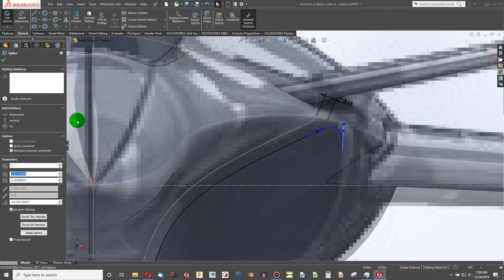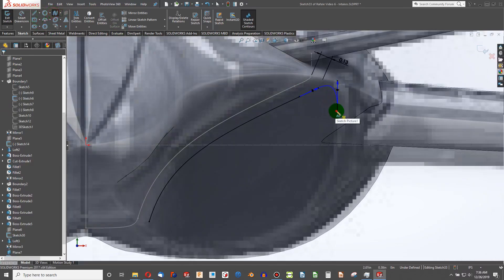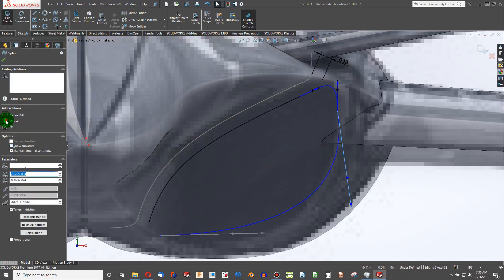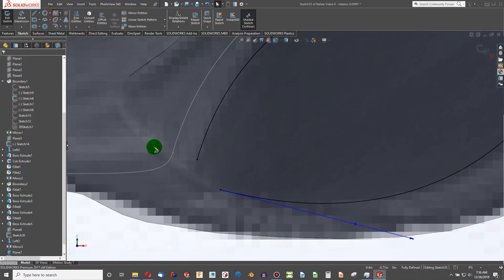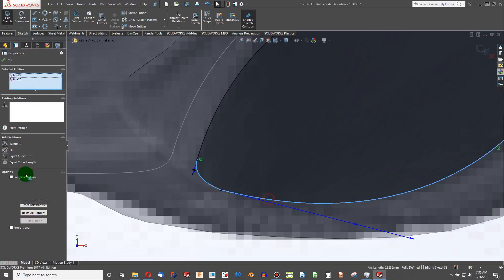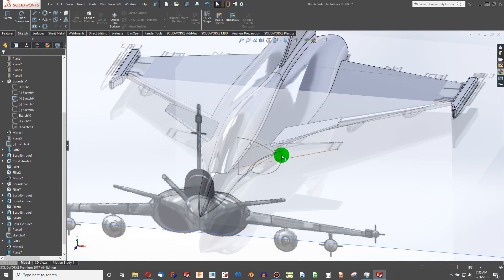Since that's fixed, I can very easily add a tangent relation and not worry about it. On this tangent handle it would be ideal to add a vertical relation — that's about where the tangent point would be. I'll set it to vertical, and this will land where it does. I'm adding a two-point spline here and need to add tangency to both ends. That looks about perfect, so we've finished up with that profile and can rebuild out of the sketch.